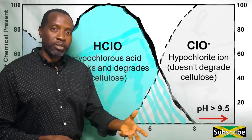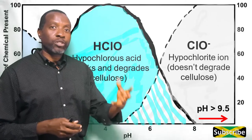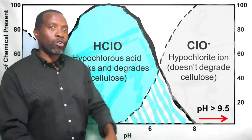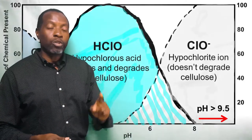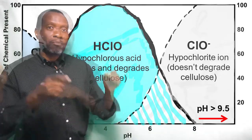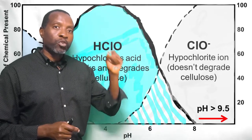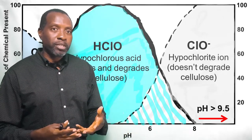The same is true for non-chlorine bleaches like sodium percarbonate, which also functions well in the same pH range between 9.5 and 11. The objective of bleaching is to remove as much lignin or color from lignin without degrading the cellulose. Sodium hypochlorite degrades the lignin, while perhydroxyl ions from sodium percarbonate remove chromophores to reduce color — both oxidizing the materials in different ways.